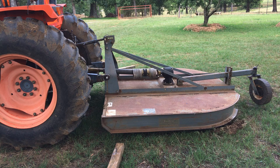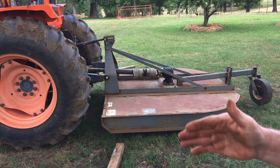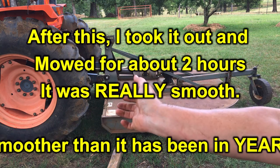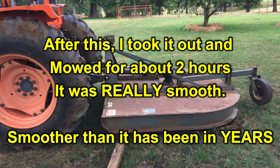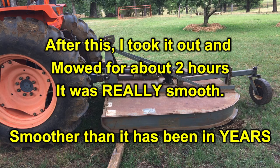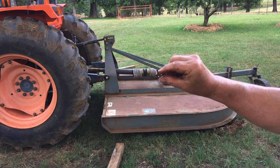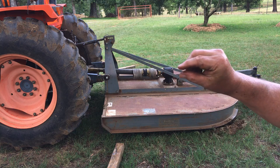Anyway, if it has backed off, I'll put another spacer in there and do whatever I've got to do to get it right. I think once I bump the RPMs up and get in some grass, the vibration is not going to be hardly noticeable at all. You watched what I did — putting a washer spacer in there, about a 16th of an inch — some of you good mechanics tell me if that's an issue. I don't see any reason why it would be.